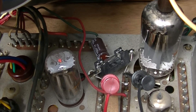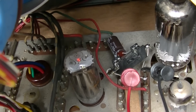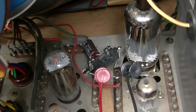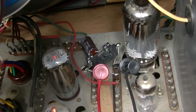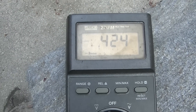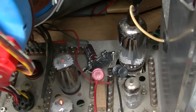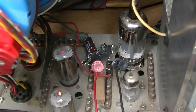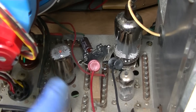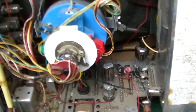I've got a 47 microfarad 200 volt capacitor, so it would blow it pretty quick. We've got a half a volt drop across the fuse. One neat thing about this is you could just measure that drop and then adjust the cathode current for the minimum voltage drop across the fuse — adjust the efficiency coil. It's been running for an hour or so and the fuse seems solid.